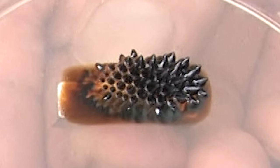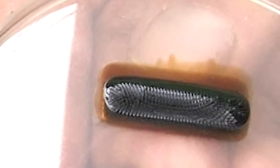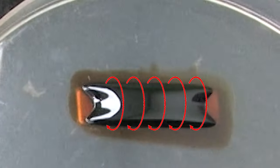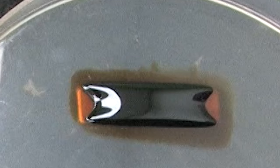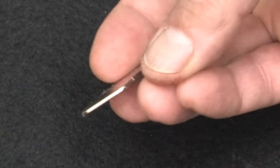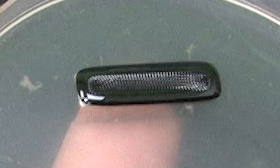the spikes become more distributed or less intense. Bring the magnet close and the spikes get more intense. If I flip the magnet 90 degrees, we can see the flux wrapping around to the other side of the magnet. This magnetic flux wrapping around the magnet is big because the rectangular magnets are thick. The magnets on the rotor need to be thin to keep the rotor inertia as low as possible, which means this magnetic flux will be real thin too. If I hold a thin magnet up to the ferrofluid, we see a much smaller amount of magnetic flux. So the magnets on the rotor are in this orientation which has the flux lines going out in all directions, and that explains why the magnets on the rotor alternate.